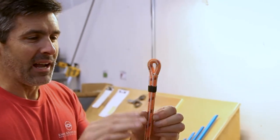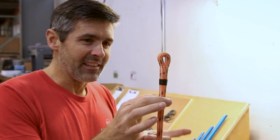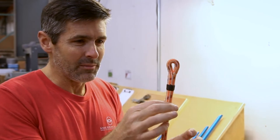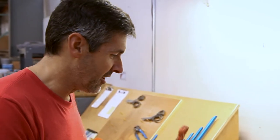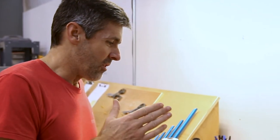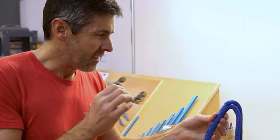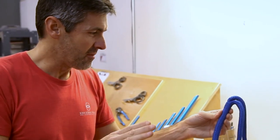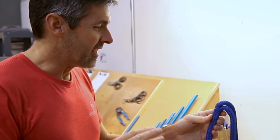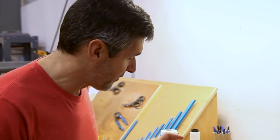That's one type of whip stitch and we do that here at Knot Rope Supply with all of our splicing on arborist rope. But on the double braid nylons or polyester over nylon combination, we'll do something more like this where we stitch it through the strands. It's hidden, it's a great color match, it's strong, and it's the best thing I've ever seen as far as stitching those.